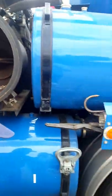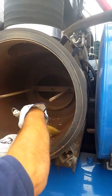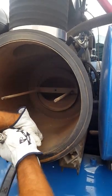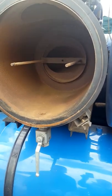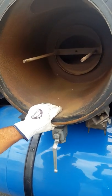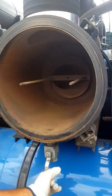Take your whisk broom and very carefully clean out the inside of the barrel. A lot of times people will use water to rinse it down, but it's always a good idea to keep this as dry as possible. If you have residual water sitting in here it'll create an environment that starts the rusting process. Brush it out as best you can and try to keep any debris from going down the drain valve.